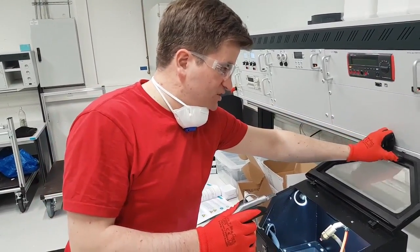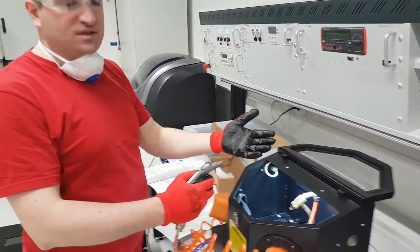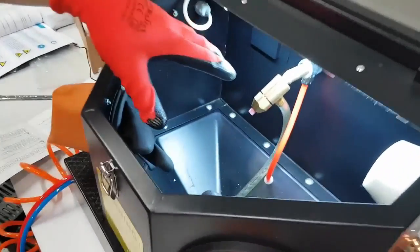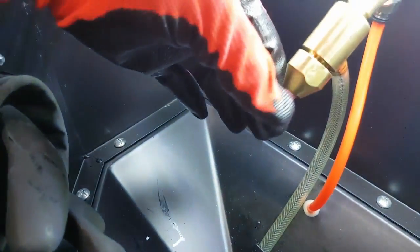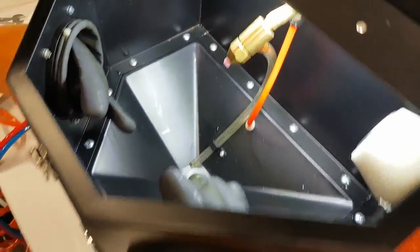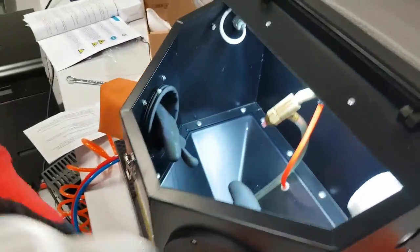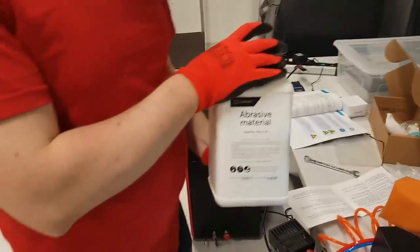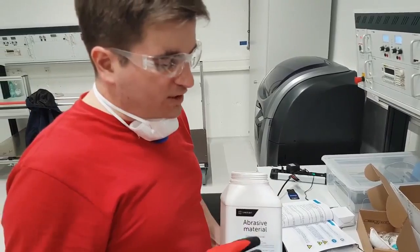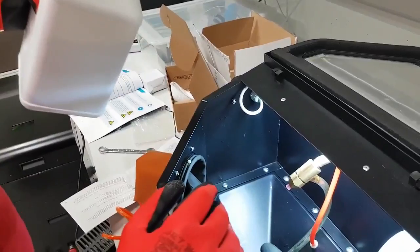The sieving station is operated with electricity too, so you have some light in there, and you have this manual tool here for cleaning. But you also have, if you put it inside, an air gun inside, and you operate it by pressing on a foot control. And then you have these gloves in there and you can clean the part in here. What we're going to do right now is put in the abrasive material that's used to shoot at the part to clean the surface — so it's blasting actually, it's more than just cleaning it with air.